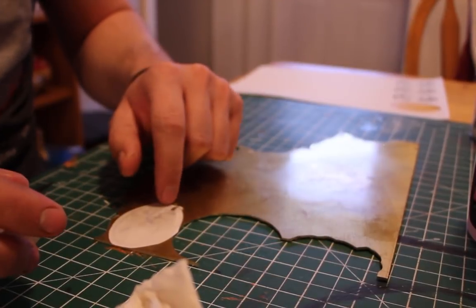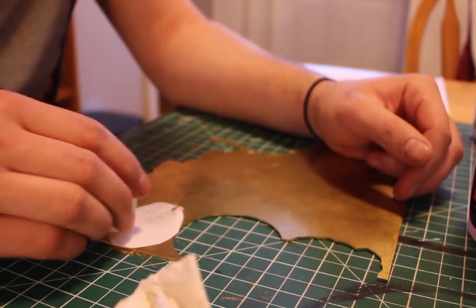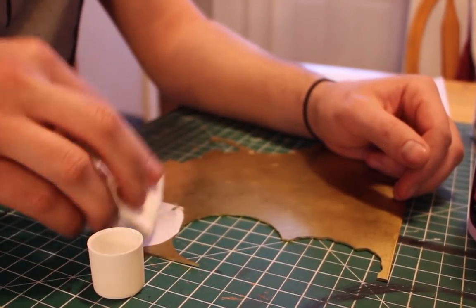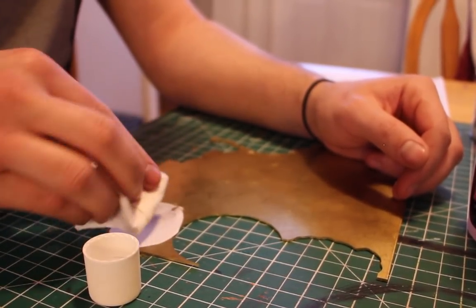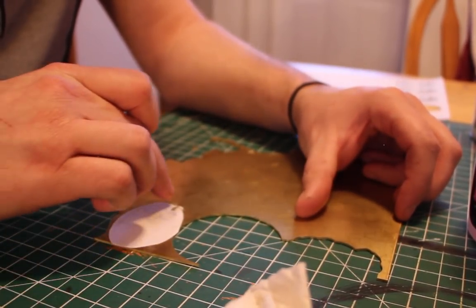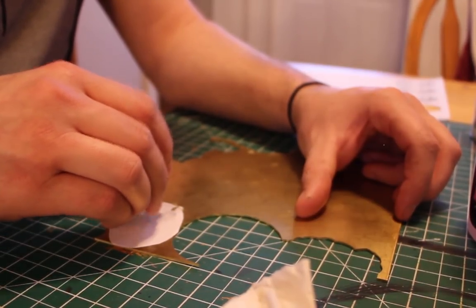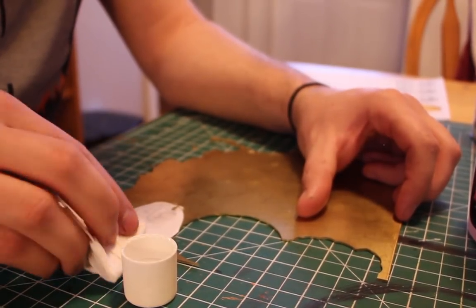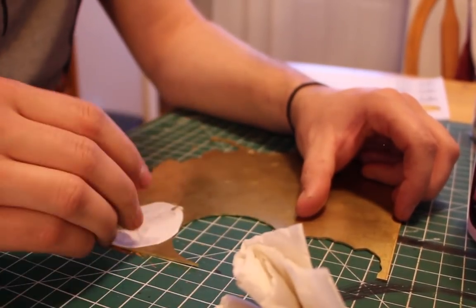So we just had a little bit of a boo-boo there. My makeshift burnisher tore the paper a little bit. But the toner, the design, was still in good condition, so I'm just going to let it slide for now because this is for demo purposes. And it was just around the edge, so I can assume where that's going to go. And since it is my logo, I should understand my logo. But if that ever happens, you may actually have to reprint your design. You can also fill it in with marker if you're confident.